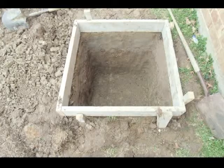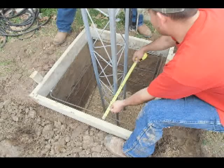Here's a shot of the finished hole. Notice how square the sides are — everything is square. I didn't actually take a photograph of pouring the gravel in the bottom, but we did put several inches of gravel down there, which you'll see in the next photographs. That's to protect the bottom of the legs of the tower. Here we are positioning the tower in the center of the hole — they're doing a little measurement. You can see the gravel and the outer cage of the rebar.